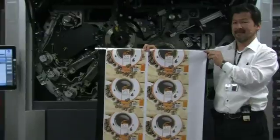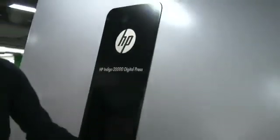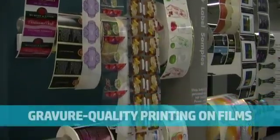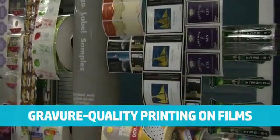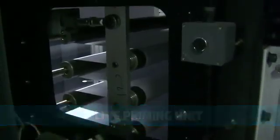Another great advantage is this press being a one-shot press. Since it is a web-based press, we accumulate all of the images on one of the drums and then in one shot transfer it to the substrates. This gives us perfect registration and also the ability to print on very thin substrates — as thin as 10 microns. So there's more to it than just flexible packaging; it can also cover the labels market. In addition, the large unit behind me is the priming unwinder — a unit which combines a powerful unwinding system, 30 inches wide and almost one ton weight of a substrate roll.